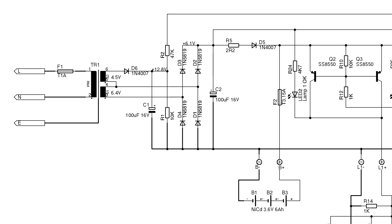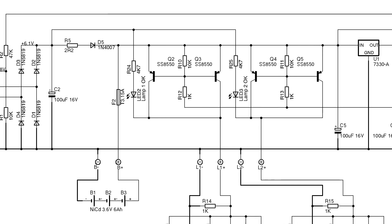Most of the circuit gets power through a chunky 2.2-ohm resistor and a diode — this is what trickle charges the battery. The diode doesn't seem to do an awful lot; I think it just makes sure the lamp-failure LEDs go out if running on battery, eking out a touch more battery run time. Each lamp is driven by a pair of 1.5-amp PNP transistors in parallel and has an LED indicator which lights if the lamp is working. That explains the presence of the 1k resistor in the lamp head, as it needs a path through without putting enough current or voltage in to actually light the LEDs in the lamp — it just wants to know that it's there.